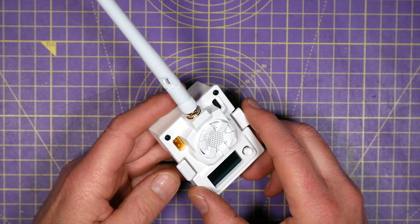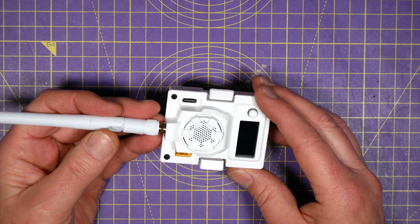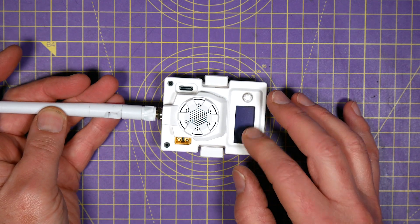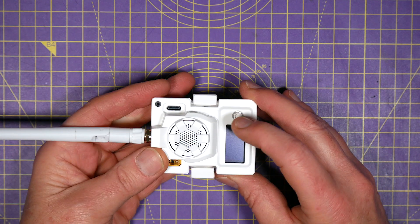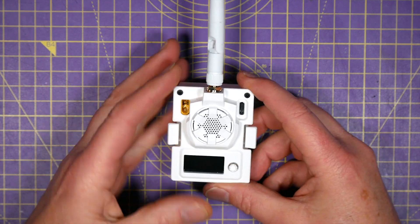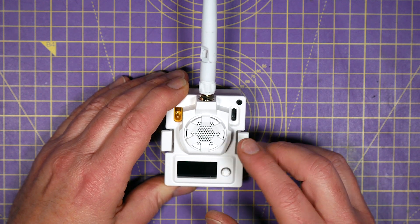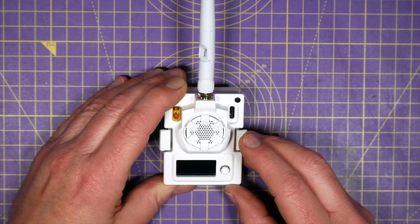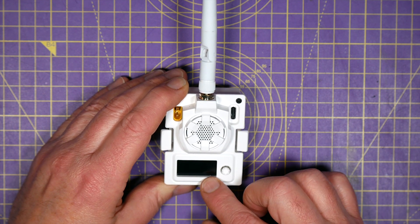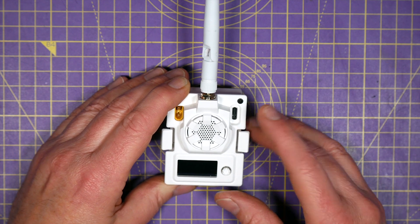There's also a 1W version available now. The price on this is $40 which is fantastic value. The only small complication is the official released ELRS firmware version doesn't support the OLED display and the joystick yet, so BetaFPV have branched the code and added their own support for them. There is a version 2 release candidate available now that does support the controls and the display, but you're going to have to check it out and build the code or download the binary and flash it.